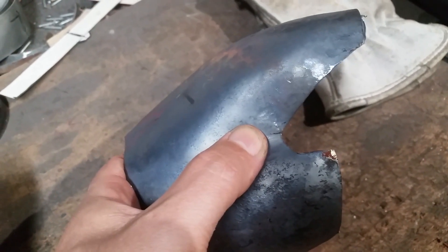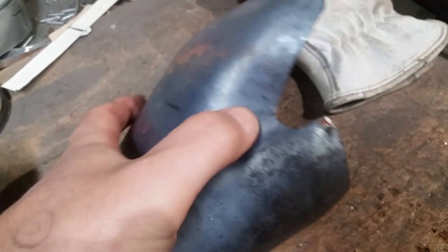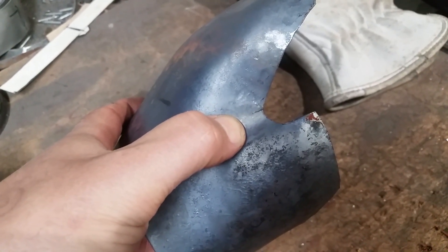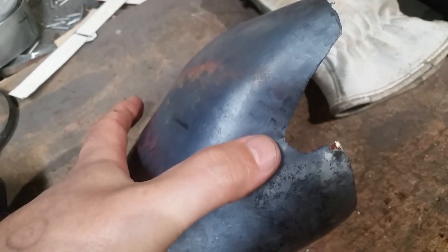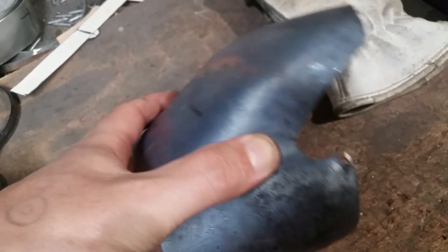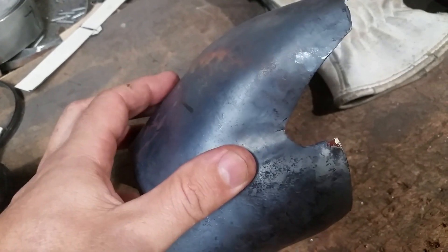The actual slide here for the web of the hand will be about where the tip of my thumb is, so I don't want that crack going into there at all because that will give me all sorts of grief. So what I thought I'd do is show what I do when I start to get these sort of stress fractures forming on carbon steel. When you're working with carbon steels as opposed to mild steel, you tend to get a lot more of this.